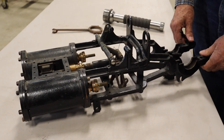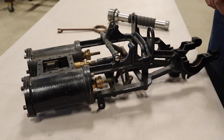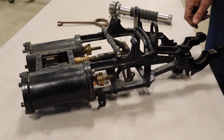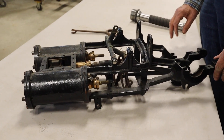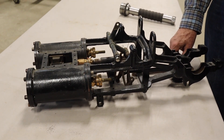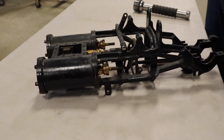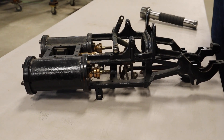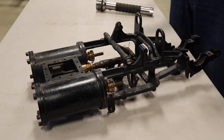With these old engines, you always have them set up on a 90-degree crankshaft so that they are self-starting. There are many conveniences to this design, and they were quite good for many years for what they were doing. They were so good that they replaced what we now have with diesel engines and hydrostatic transmissions — they were able to replace all of that. But the thermal efficiency was absolutely terrible, and it would take a book to explain all the reasons why this is a poor thermodynamic, thermal efficiency design.